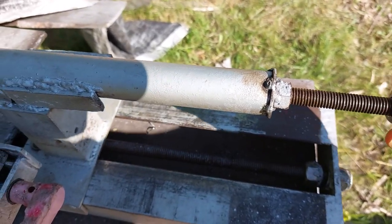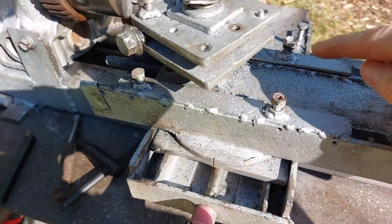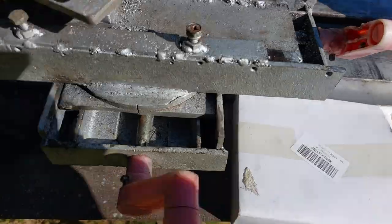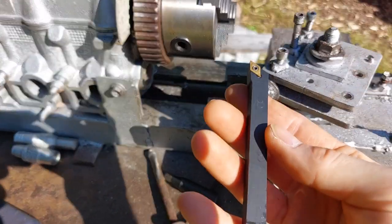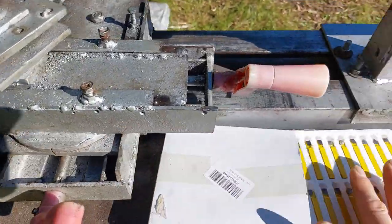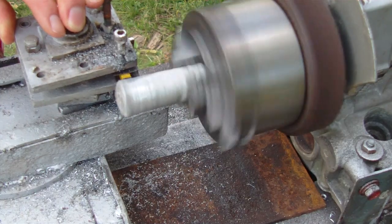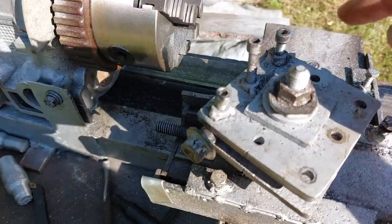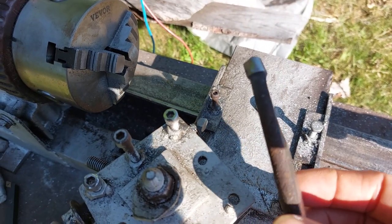Because there was so much play and it wasn't working properly, I had to add all these little screws. I ordered cemented carbide cutters, but found out after that these were not the way to go. I also ordered a carbide insert cutter — I figured I shouldn't have bought the solid carbide and should have just gone with the insert from the start. The insert tool was about ten bucks and the carbide inserts are really cheap. When I used the lathe with the carbide cutters I wasn't getting great results — a video confirmed that carbide isn't the way to go with a homemade lathe that has a lot of slop. So I took a grade 9.8 bolt — like a head bolt or cradle bolt from a car — and ground an edge on it. I was able to cut with that and it was pretty smooth.